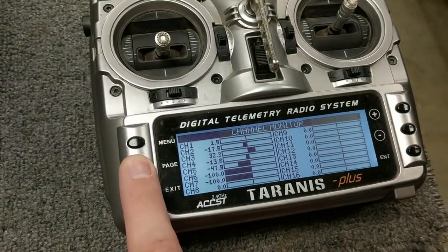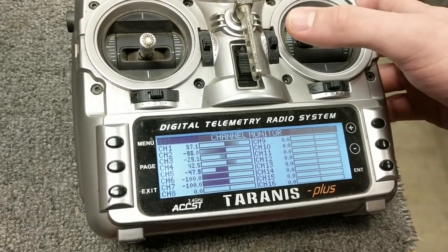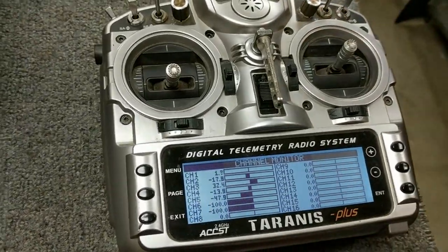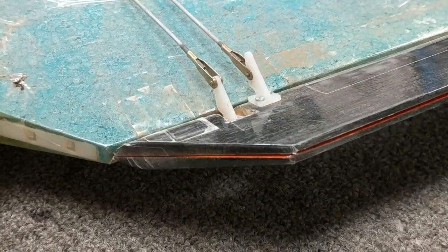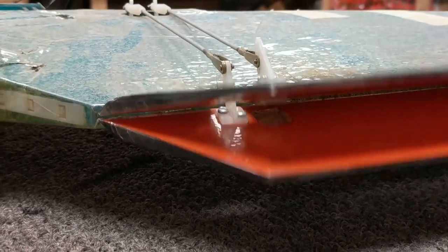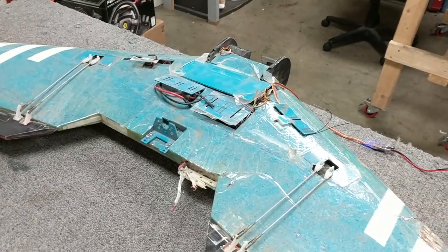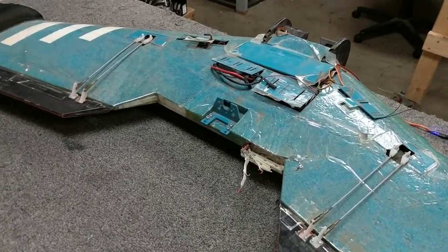If I pull up my channel log here, you can see those are the four servos, and you can see all axes of control operate all four servos. That was an issue of just going through the Taranis and carefully picking the endpoints, midpoints, and throws such that the servos would not push against each other in a neutral position and could move through their full range of motion without binding. These are analog servos, which means they don't have a tremendous amount of strength slightly off-center, which is great for this because if the surfaces bind slightly, the servos aren't going to burn themselves out — whereas a digital servo might do that.